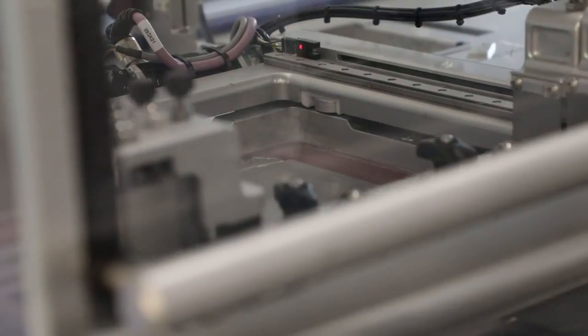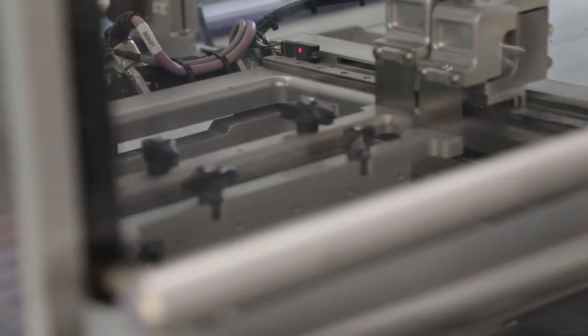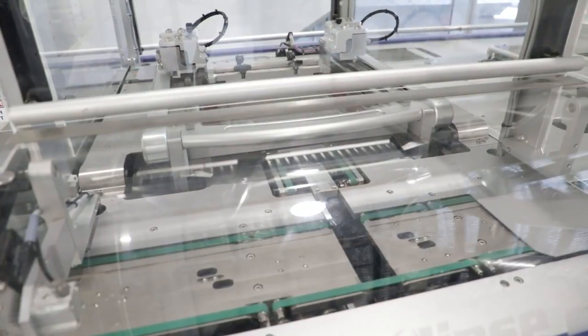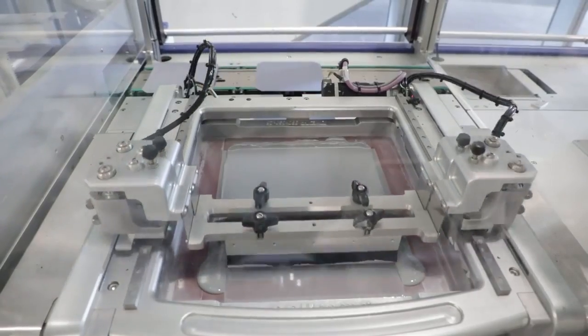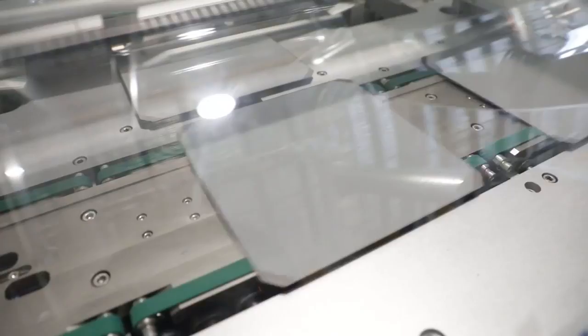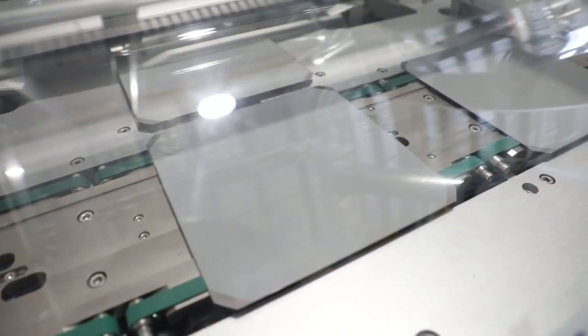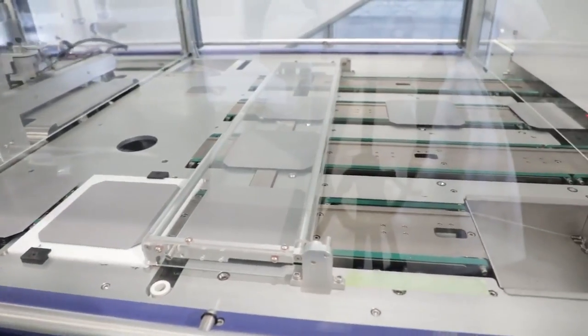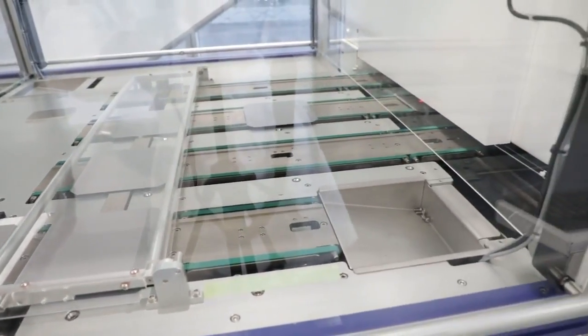During the printing process, a squeegee is used to force paste through the screen mesh, and a flood bar is used to replenish the paste after each print. Between 1.32 and 1.36 grams of aluminium are deposited on each wafer, amounting to a contact thickness of between 20 and 30 microns.